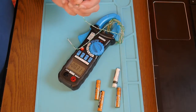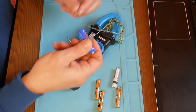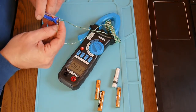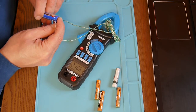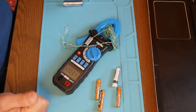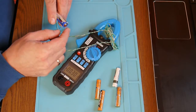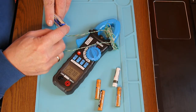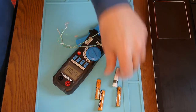It's almost like a transformer — it multiplies the current 10 times. The last reading was about 2 amps, and now look: we get 23 amps, 22 amps. This is because it's a coil now, inducing 10 times more current than before. So now it's much easier to read — just divide by 10. We got 20.8, divided by 10, of course.